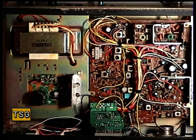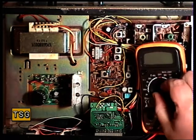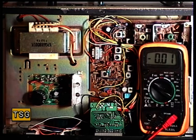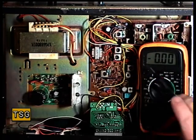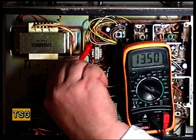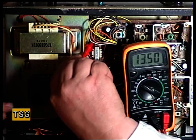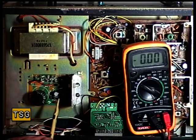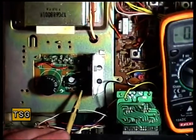So the first thing we're going to do is switch it on, and we'll see that the power supply is running at something like the voltage that we require, which is 13.8 volts. Now I don't know whether this is a floating chassis or an earthed chassis, so we'll just find a point at which to test it. What we've got is 13.5 volts, and that will do me nicely. If we needed to adjust the power supply, the regulation control is just down there on the power supply subboard, neatly under the shadow of the heat sink.